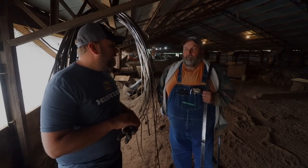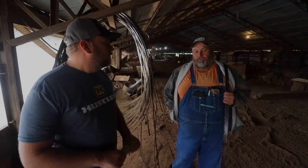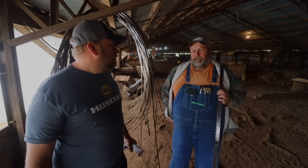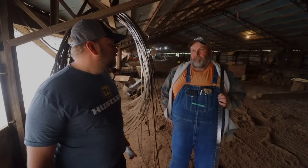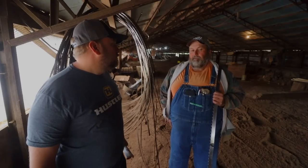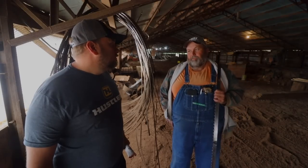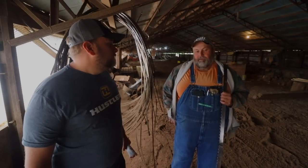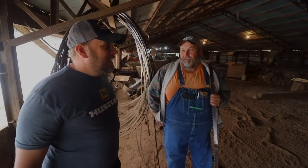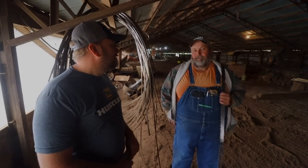It does. But for you, you found sharpening them once is worth it. Sharpening them once is worth it. And we actually found this out on Woodmiser brand blades, that if you sharpened them twice and ran them that third time, they would likely break. And breaking a blade while it's in the cut is a headache. It'll get wrapped around your blade wheels or something else on the mill. We actually had a pair of tin snips designed just for cutting blades because we could cut it apart and get the blade out of there quicker that way and be back to going.